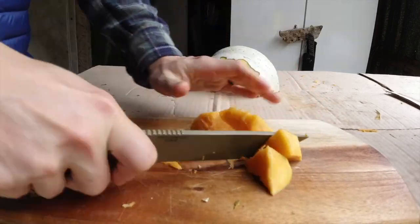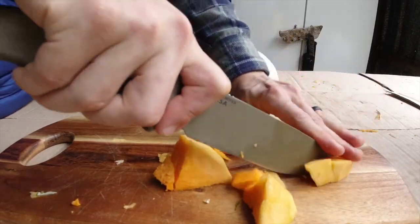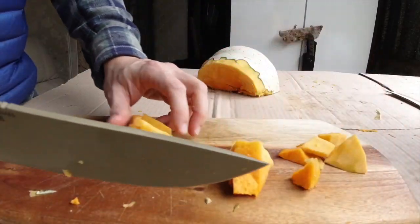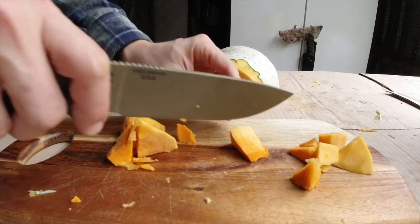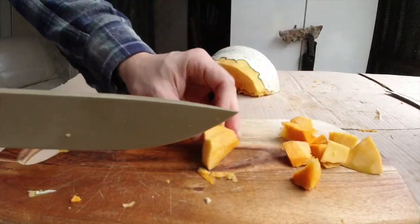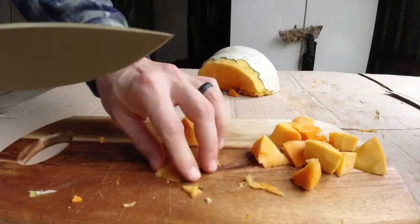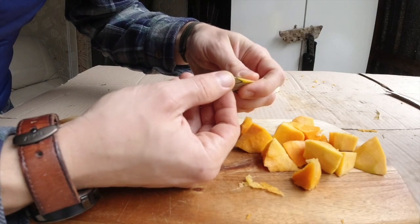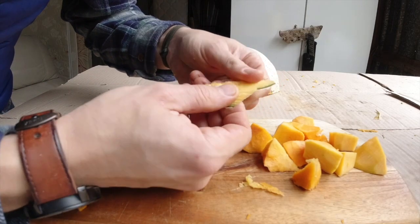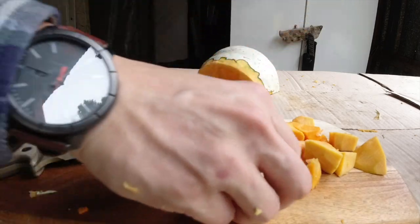And I think that the coating that they put on these ESEEs, and the same coating that's on my Kabar, led to a pretty similar effect in the two knives when I tested them, in that they behaved like a knife that's thicker behind the edge than the steel itself, because the coating actually adds to that behind the edge thickness. Here's a close-up. I tried to capture some of that fracturing so that you can compare it to what the Tops does later on.